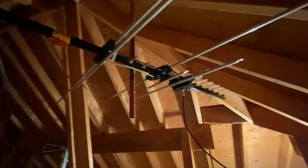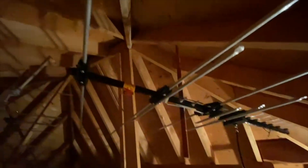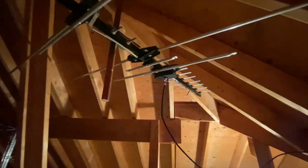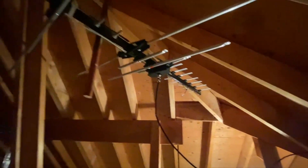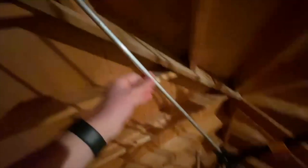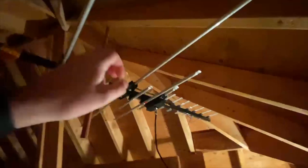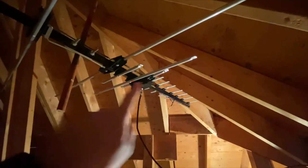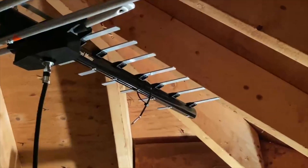Here's a model of more of an attic or outdoor antenna. This is a Low VHF, High VHF, and UHF antenna for a moderate to weak signal area. You can see the long Low VHF elements in the back, some High VHF elements which are long but not as long, and then the UHF ones which are really tiny. People don't like having these big elements to pick up TV.